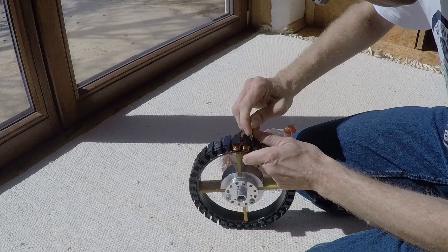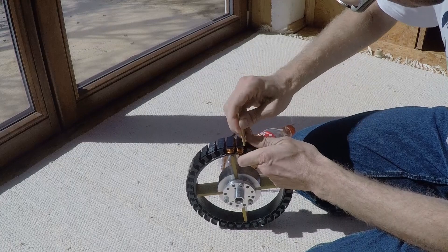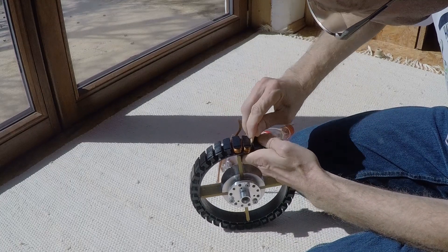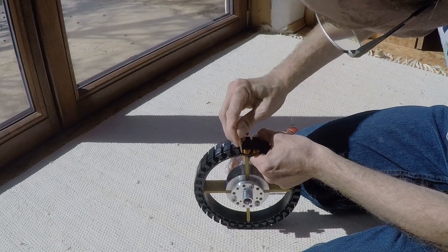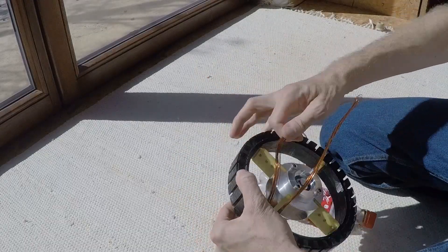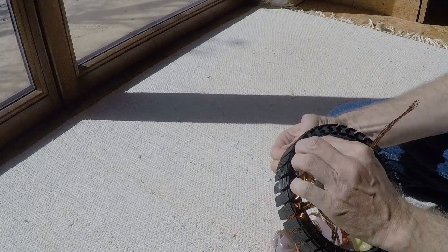With a piece of wood I always compress the windings before doing the next one. All the winding has to be done as similar as possible — that means keeping your winding style and pulling always with the same force. That is crucial to get the same electrical parameters for each phase.